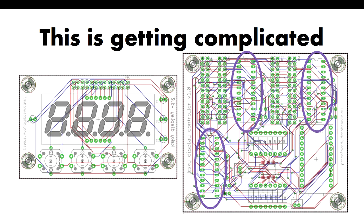These are the two circuit boards I had to design and fabricate to build that control panel. You can see the three LED display drivers daisy-chained together to run those 160 lights. There are lots of lines everywhere because every single LED needs two connections back to a display driver.